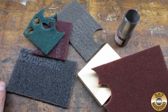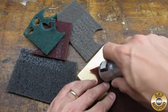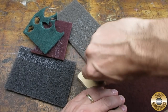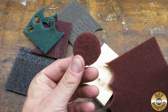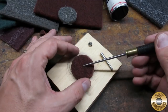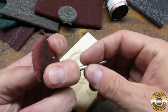I decided to use my homemade Scotch-Brite wheels to clean up the tri-square. I got this idea from 805 Road King. I sharpened the end of an exhaust pipe adapter and used it to cut out discs from Scotch-Brite pads. Making my own discs allows me to try different brands and grades of abrasive pads. I used the cut-off wheel mandrel along with a small washer, eyeballed the center of the disc, and poked a hole with an awl. Finding exact center isn't critical — the disc will quickly wear in true during use.